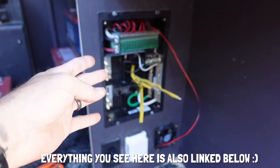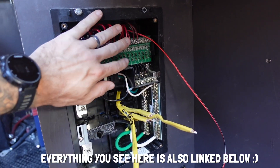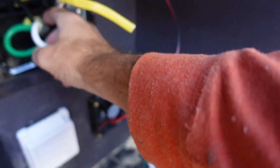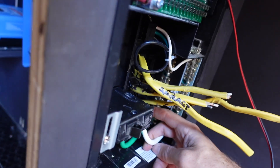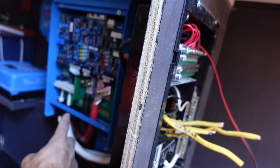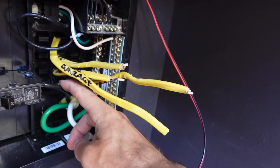I'm at a point now where it's a good little break in the electrical to explain a few things and show you where I'm at before I completely finish it. Right here I'm wiring up the panel — it basically has two-in-one. The 12-volt is all up here and then the 120 is all on the bottom section. Let's concentrate on this wire that's coming in: this is a 6-gauge wire that comes from the output of the inverter. This chunky wire here feeds this panel, comes into the panel here.